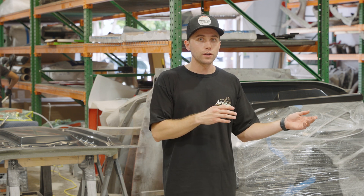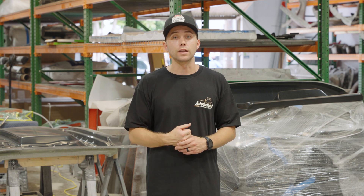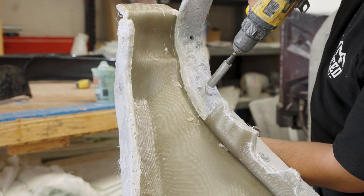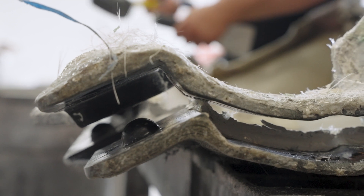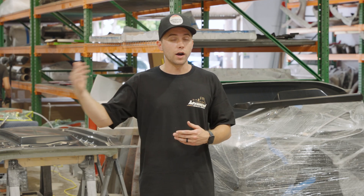The part then gets passed over. It'll sit overnight for about 24 hours, and then our team will demold it — they'll pull the parts from the mold. As we showed you on the Bronco Raptor video previously, we have flanges. Those flanges need to come off the mold so the part can come out as well. After it's demolded, the molds will get prepped again and go through the process.